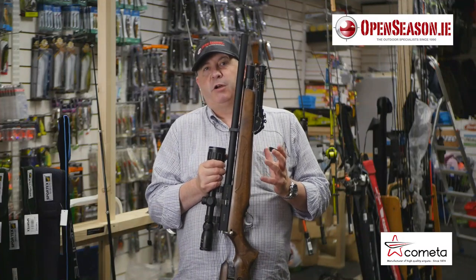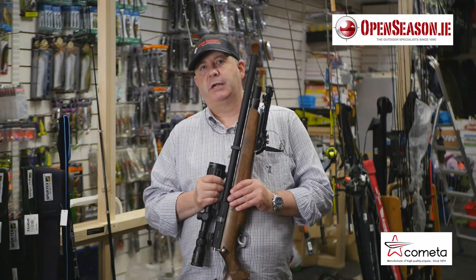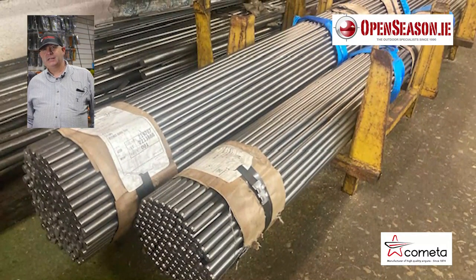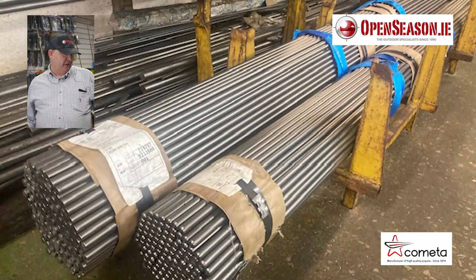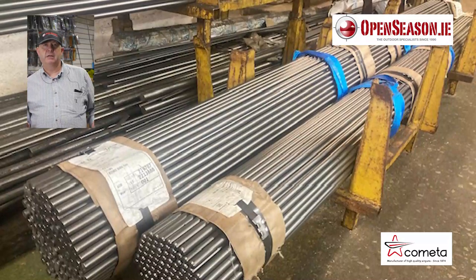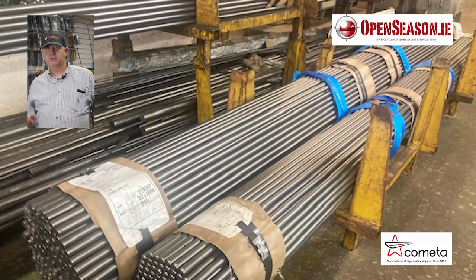Whether you're interested in air rifles or bigger caliber rifles, this is frequently the system of how a barrel is actually manufactured from scratch. The first step in the manufacture of the barrels is, you see it in this image here, the steel bars come in their raw form into the factory. They're made from carbon steel with a small amount of lead mixed in to make them supple, and they're made specially to Cometa's own specifications. And you can see the big huge bales of steel rods that come in.